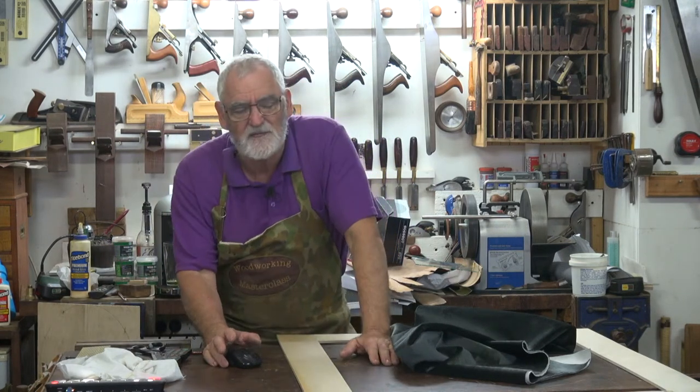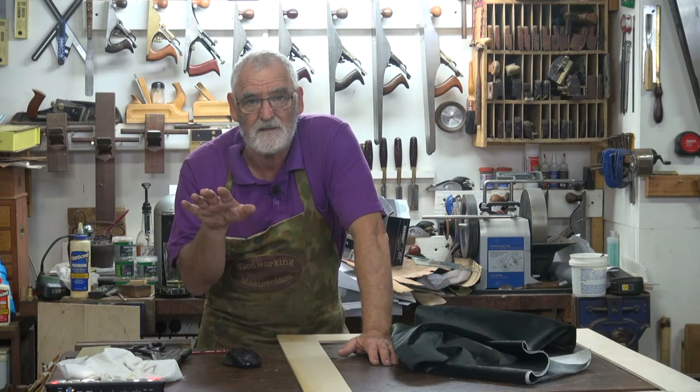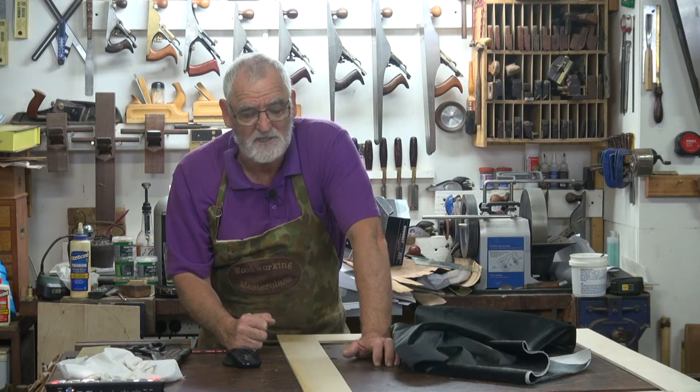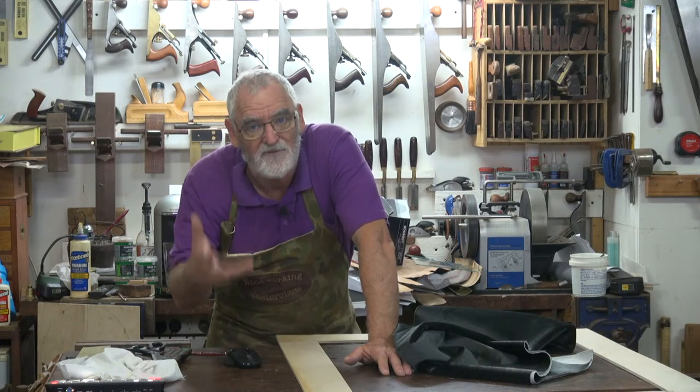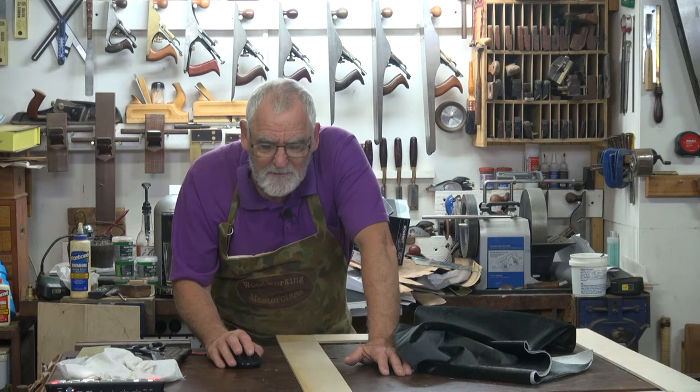If you're going to make a knife, don't just make a knife out of a chisel or a punch or anything like that, or out of an old file, because it's going to be too brittle and it's dangerous. They can shatter on you. But if you normalise them, then go through the heating process, all good.